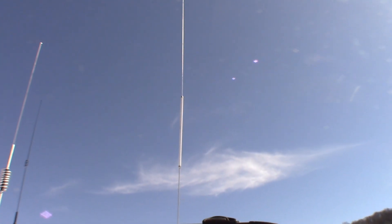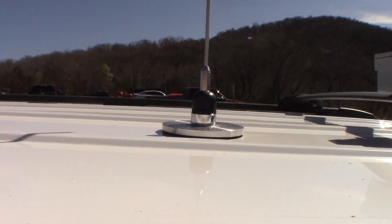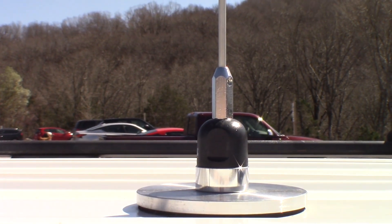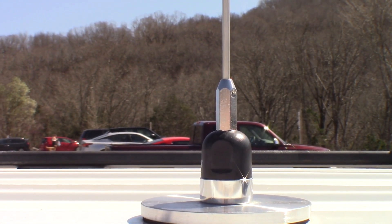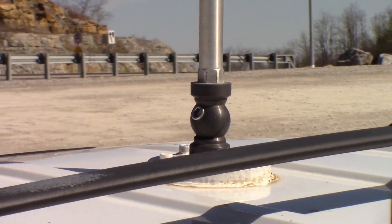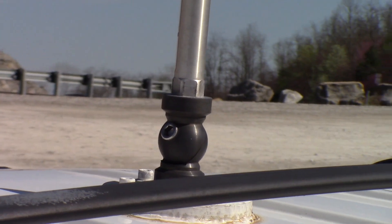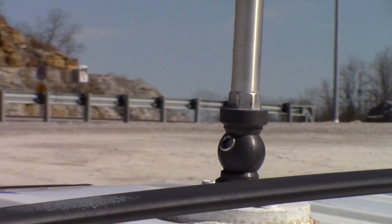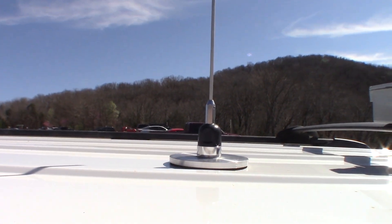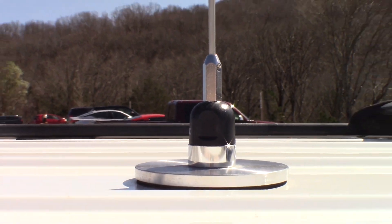It is a 2-meter monoband co-linear antenna. I've got a custom-made Breedlove Mounts puck mount with an NMO mount, and then from NMO I go to the 3/8 by 24. The reason I had to do that was because if I use a standard CB mount like the one back here for the Predator antenna, the SWR was horrible and I could never get it tuned out right. Once you're up on VHF frequencies you really can't use these big ball mounts — they cause too many problems. With an NMO to 3/8 adapter, this thing tunes down to a 1-to-1 perfect SWR.